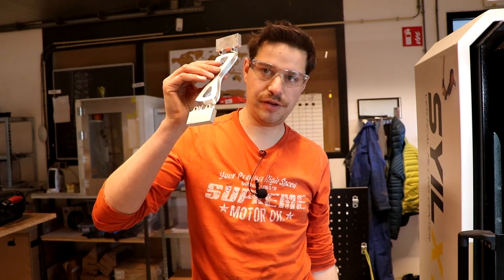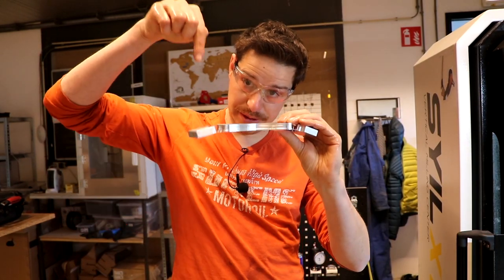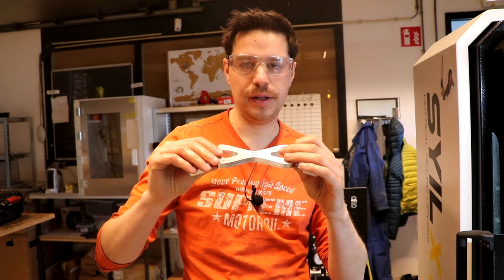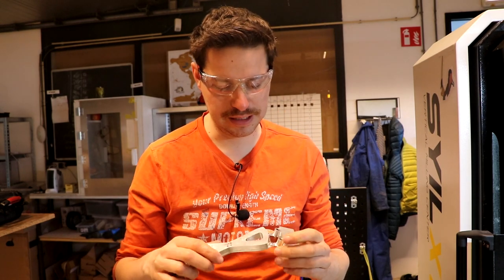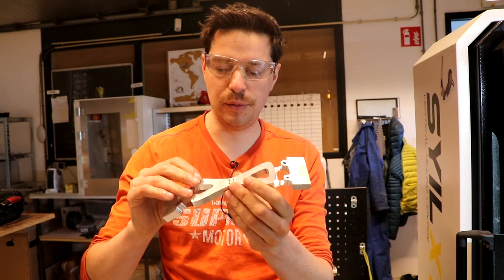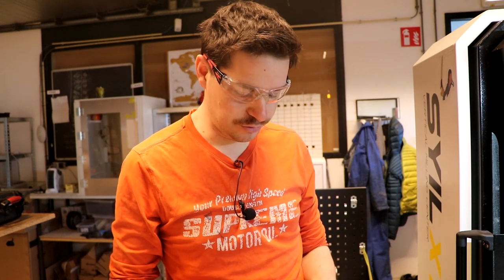So this is why I'm nervous. I only have one block left, and the end mill — which did the cutting — came in too deep. It was offset wrong. I did something wrong on the previous operation, so it was too thin and started to chatter when it was removing more and more material. I only have one piece of aluminium left, and this ain't gonna work. So I have to start over.